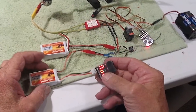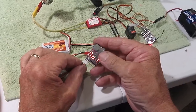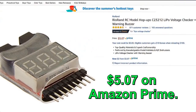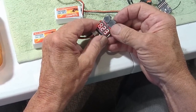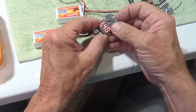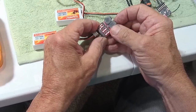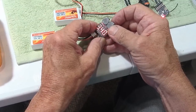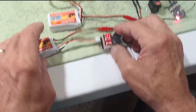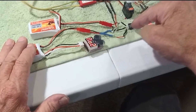To put an alarm on there so you know what's going on — on one battery alone I've got this low voltage battery tester. These things are really cool and it'll plug right into your charging jack like this. You can set it by pushing this button where you want the alarm to go off. Right now there's 4.11 volts in one and 4.12 in the other. If I go ahead and set it — 3.40, 3.50, 3.60, 3.70, 3.80, or off. I'm going to set it for 3.80. So when this battery goes lower than the second battery, the Schottky diode seamlessly switches to the higher voltage battery.